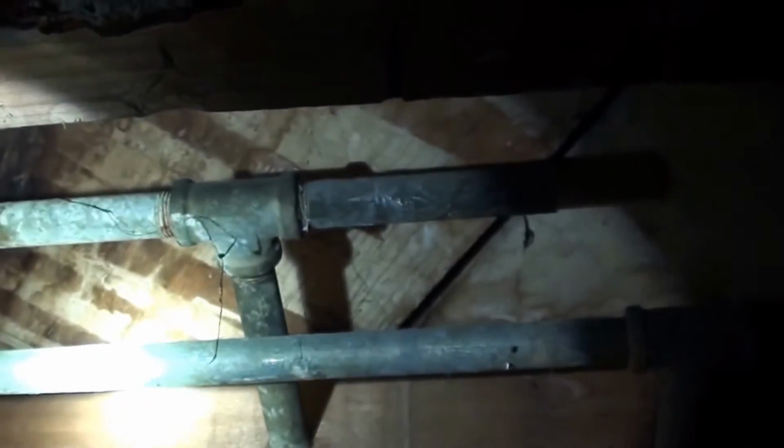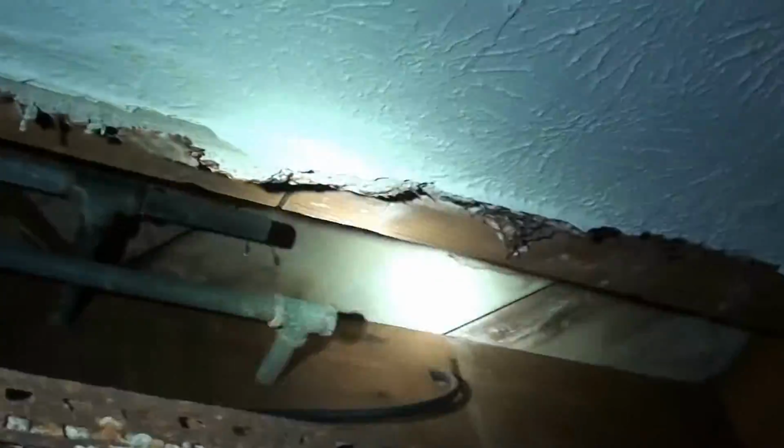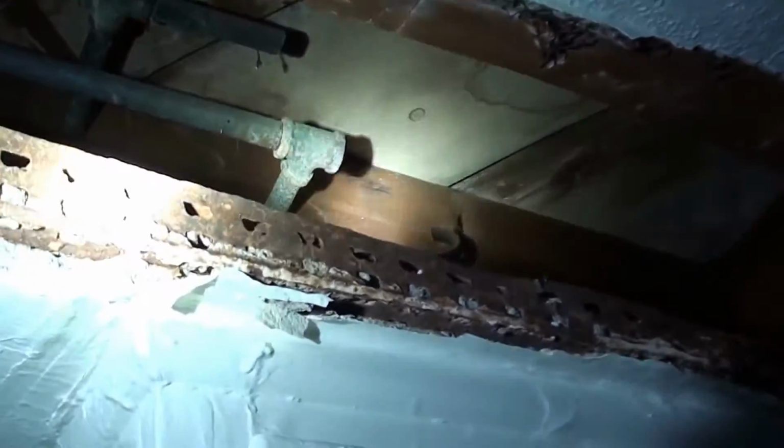Okay, putting the heat on the one did work. This one has already started spinning, and I didn't have to do anything to it. One good sign, because whenever you mess with galvanized, you're worried about every other joint. Just a simple vibration of cutting the pipe, definitely turning it, you can snap a fitting or make another joint leak.